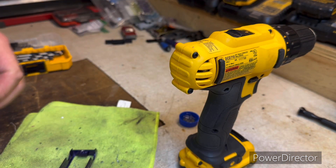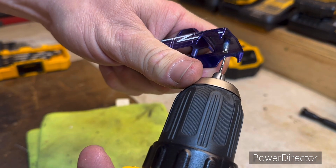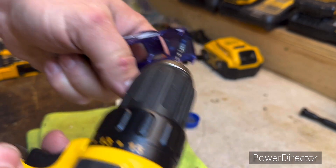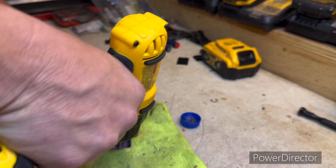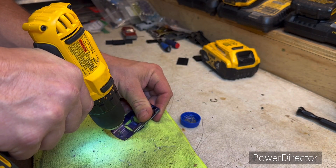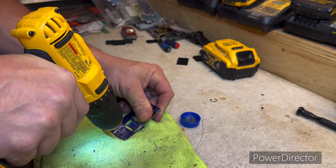You'll see the end of the screw but it doesn't matter on that one. This may be a lengthy process so I may pause the camera, but I'll show you. We want to drill this out to where it's just barely in there — deep enough to have threads. Get a little WD on the tip. Make sure you try to hold it straight. Drill slow — you'll see the shavings curling up out of the hole.